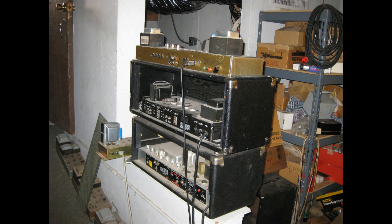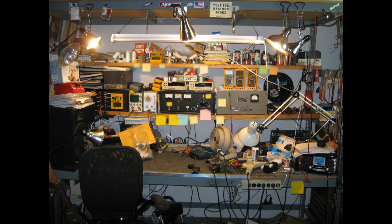Let me show you a few more photos from around his shop. This is his tube burn-in station — it's old amplifiers and he basically plugs tubes in here and runs them between 12 and 48 hours, longer for output tubes. He says that if you take a new tube out of a box and want to bias it right, it's going to drift over the initial burn-in. So he burns in all the tubes before doing any biasing on his amplifiers.